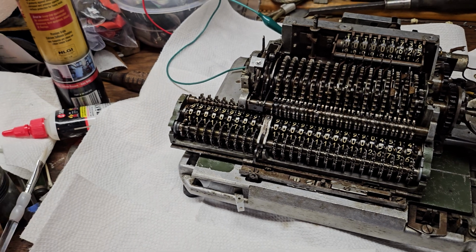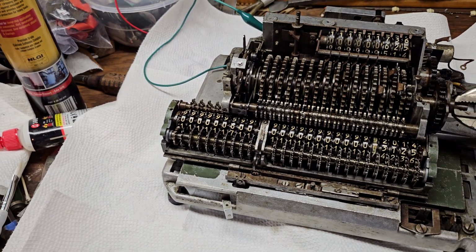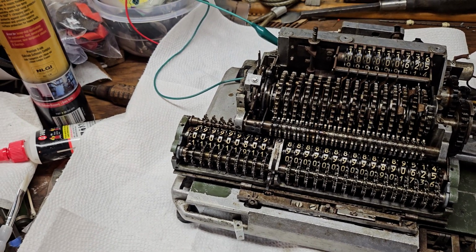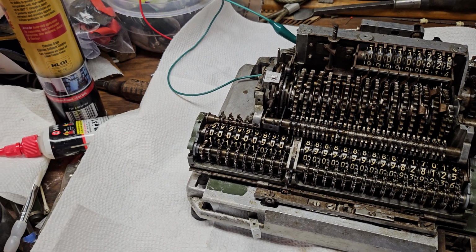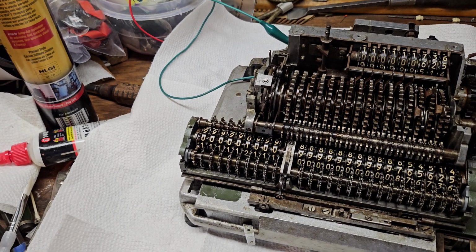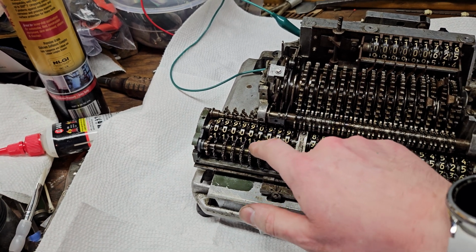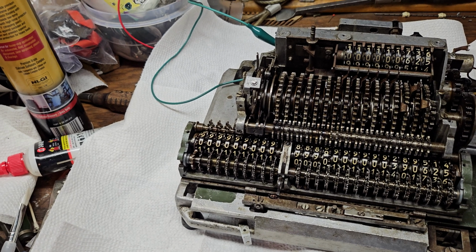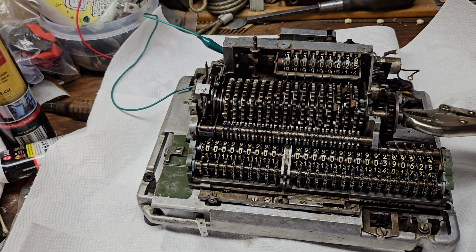So, yeah, and as soon as this comes around, the pin will retract, the carriage will jump, clutch re-engages, and we're adding. And now as soon as this gets up to 0, because this is a shortcut, it will just carry over 1 to the next column. You can see there, went from 9 to 10. Now this column has a 1. So again, the process repeats. Just because there's a 1 in this column, it gets back to 0. Carriage goes all the way over, and we're done.